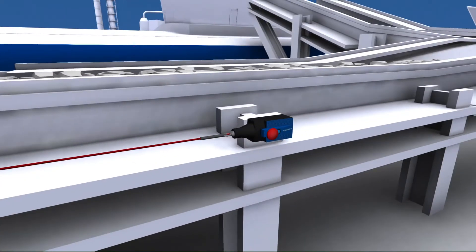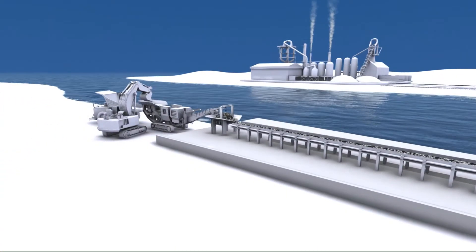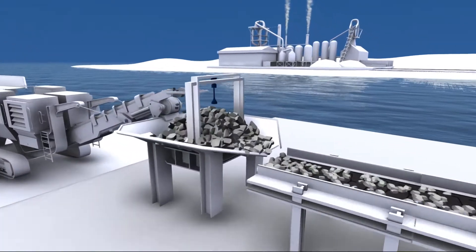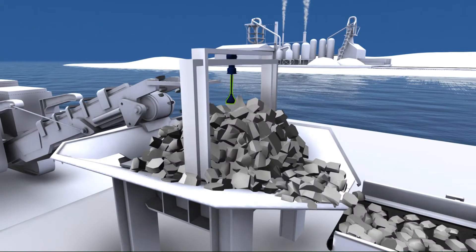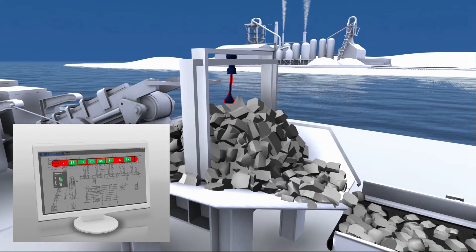The corresponding state of the plant is reported to the control room via networked signal devices, or locally via optical or acoustical warning devices in the vicinity of the plant. Level switches prevent material overflow by automatically shutting down the part feeding equipment when a fault occurs in the conveyor. In large plants, integrated bus systems directly transmit signal states to the control room.